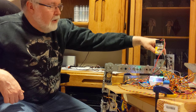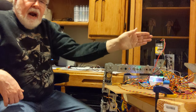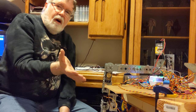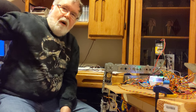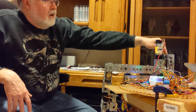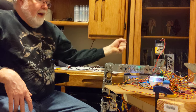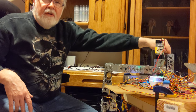I actually have another motor back here that rotates the entire arm — that's a rotator cuff. With that motion I can make the arm not only go up and down, but it can go inward towards the chest and outward away from the chest. That works, but I don't have a strong enough servo back here to handle it when everything gets turned to the side — it gets too much torque and starts slipping. So I've got to come up with a stronger servo back there.